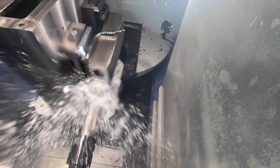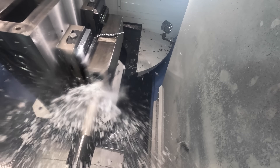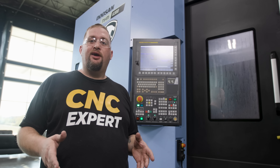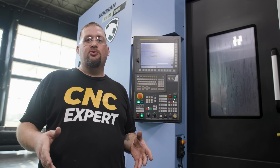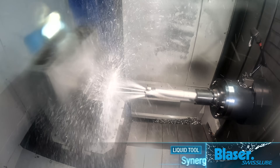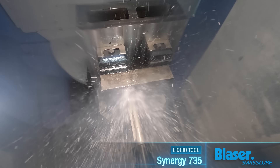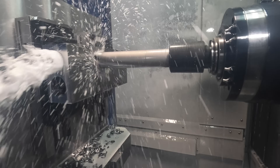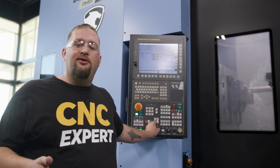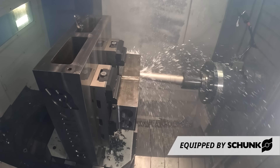What we did is we looked at Kennametal's recommended feeds and speeds and we're actually down at the bottom end of the feed. Right now we're at about 170 foot-pounds of torque — it's pretty insane. This is a pretty big tool, but you don't want to copy our feeds and speeds in this case. Our spindle load is around 170 percent. We're able to do that because we're not constantly in cut.